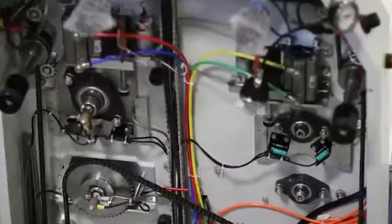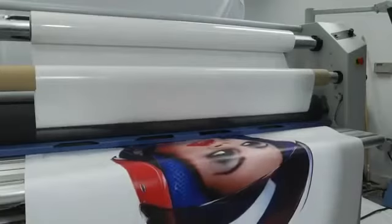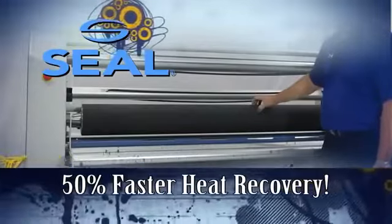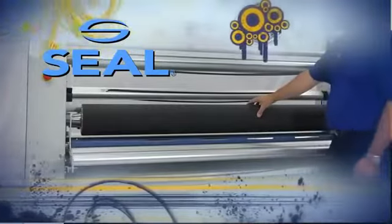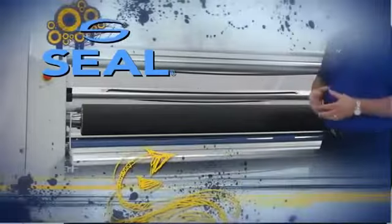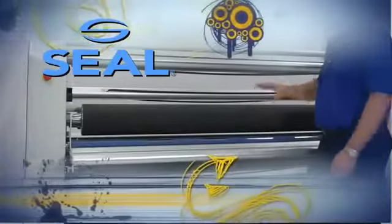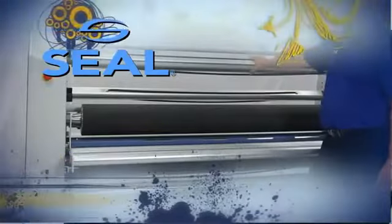You guys that are doing this, you know that when you run hot applications through, that roller cools down a little bit. But because of the specialized material we're using on this roller, the recovery is 50% or more faster than any other laminator in the market. And that's important when you're in a high production environment. The way we heat this roller up is using what we call infrared quartz heaters. This actually allows the roller to heat up more consistently and faster. So again, that's a production problem that we've solved in the brand new 65 Pro MD.